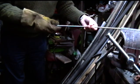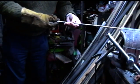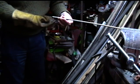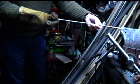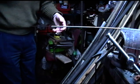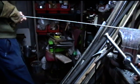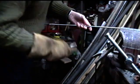So it's not as good as I was hoping it would be. I'm tempted to think I'm probably going to have to go with plan B, which is heating the spring up, which isn't a way that I want it to go. I can't predict what it's going to do. See, the spring is deformed again there in that centre, so it's lost its temper at that point there.